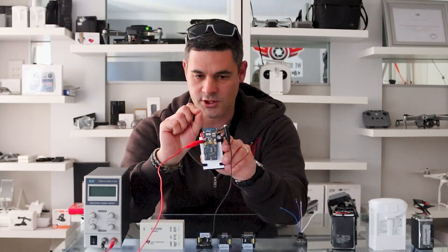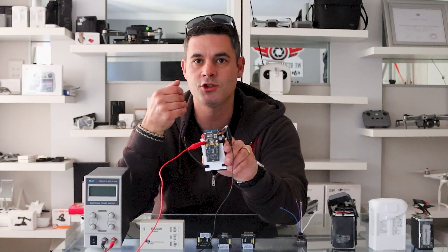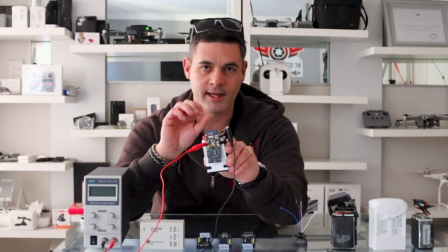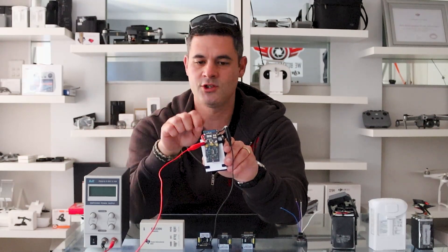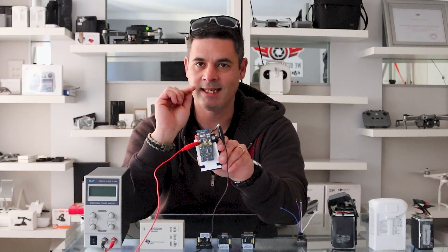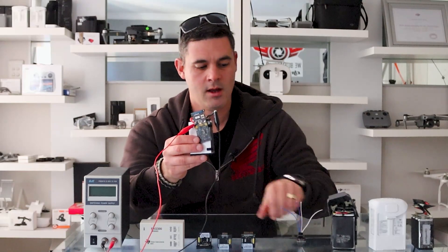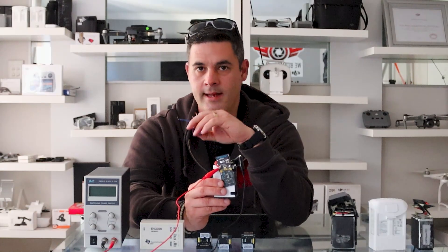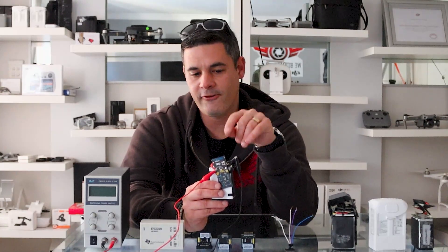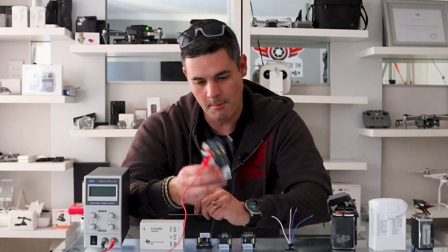If your cells are good, use the bench power supply to trickle voltage in until it reaches nominal charge voltage — all the information is on the back of the battery. Take your time, even if it's half an hour or 45 minutes. When the battery is full, multimeter each and every cell. Make sure they're relatively even and there's at least 2.5 volts in each cell. If so, take it off the bench supply and plug in your CP2112 again.